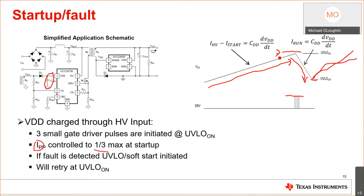Okay, well, if you're charging a battery and you have a faulty battery, you don't want your 5 volt, 10 watt supply delivering 2 amps forever. Okay, your cables are going to get hot. You could even melt your connector. So this is a protection feature.